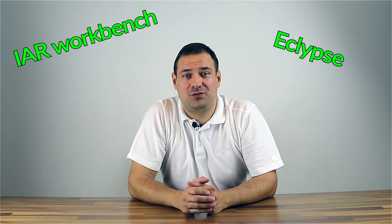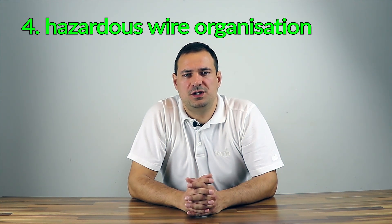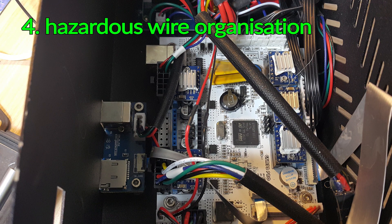As I'm a programmer, I have checked the code — it's a state of the art Ikebana with no consistency. But they are working on joining the GTM32 board sources with the latest Marlin release, and this should happen soon. Another thing I encountered is a clumsy and hazardous wire organization in the mainboard box. Wires can melt as they touch heat sinks, and the fans cannot operate normally as they are blocked. This falls under poor quality control.